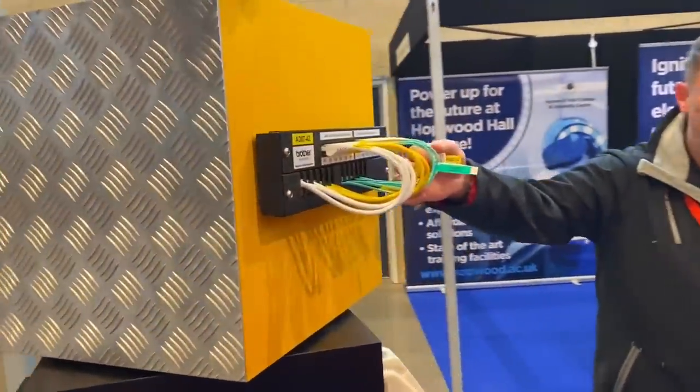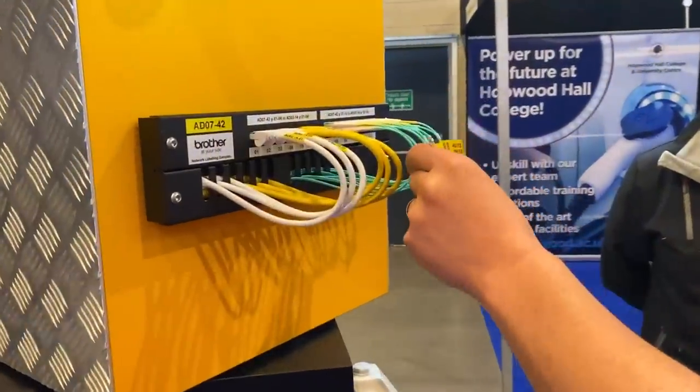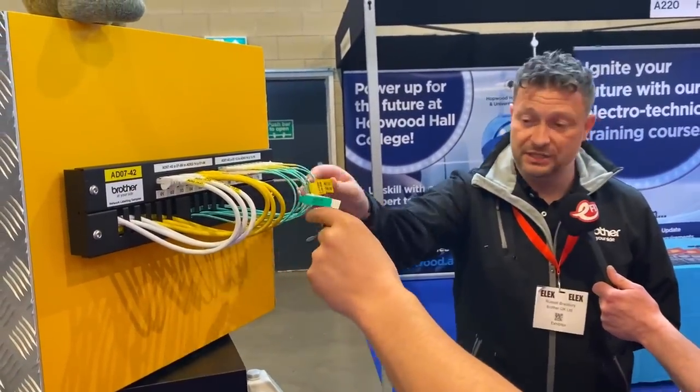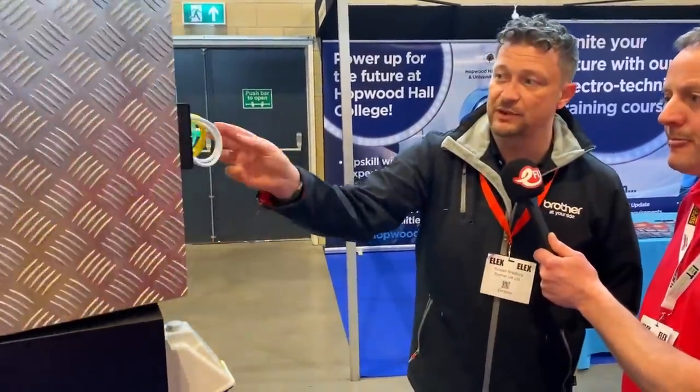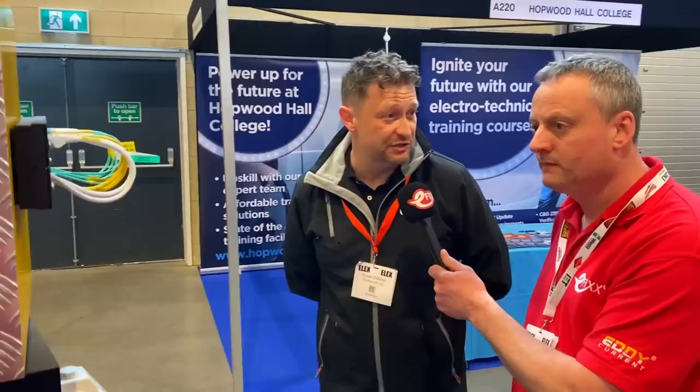Is that a different tape just for flags? Different tape just for flags. What's better for the environment is that all the cassettes are made compatible for every different machine and every different size of label, so you never have to throw away any plastic. We're also thinking about strings coming off solar PV panels, having to be identified throughout their run — that's maybe where a tag style one comes in. Network infrastructure and data we're normally fine flagging. For cable work we use heat shrink — we've got 25 years on those. They can be buried under the ground, dug up 25 years later, and you're still able to read them.